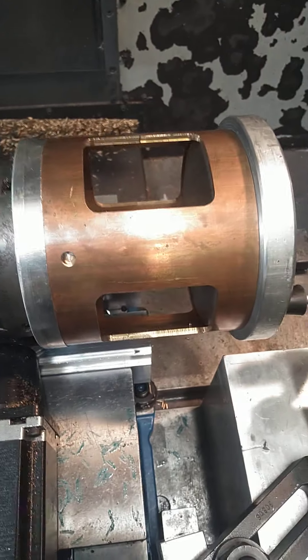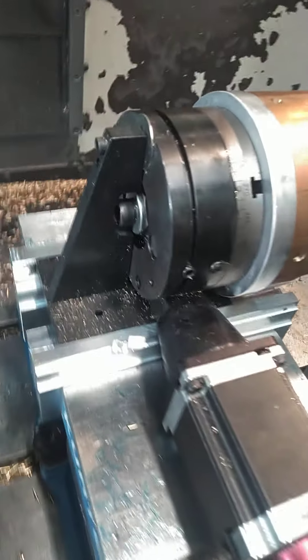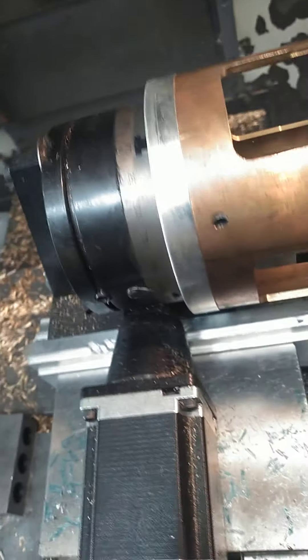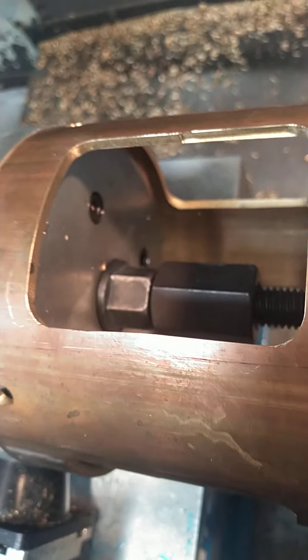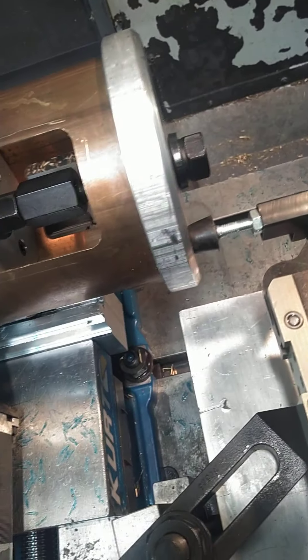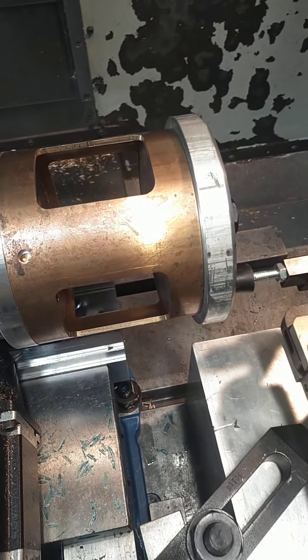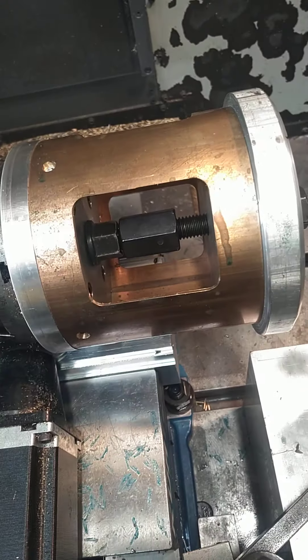I've got it stopping at zero every time it indexes. One of the things is the backlash in these indexers — these are only intended for engraving — but as you can see, we added a jam nut feature. I also took the face off and drilled and tapped it for quarter-20s so I could hold this fixture in with quarter-20s and keep it nice and rigid. Got a half-13 stud going through the center. It's a big job — I'm going to make several hundred of these things.